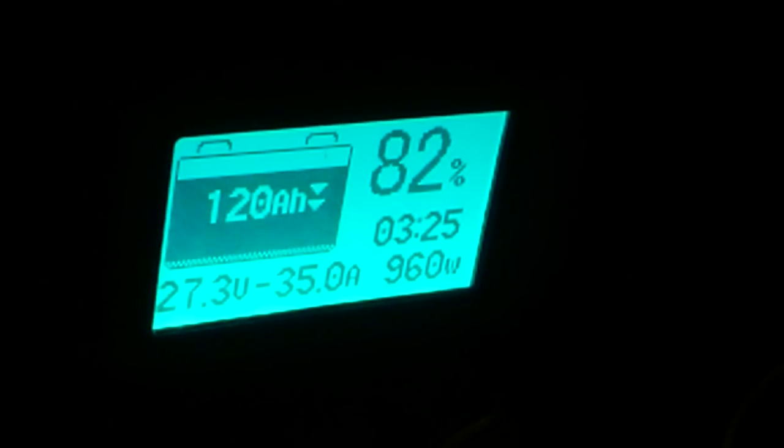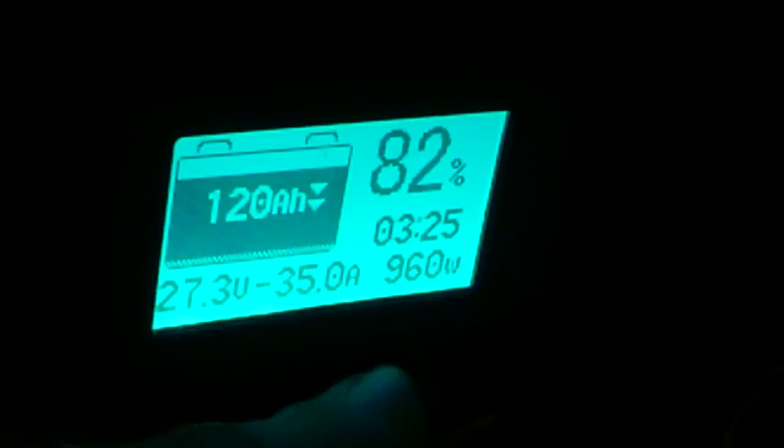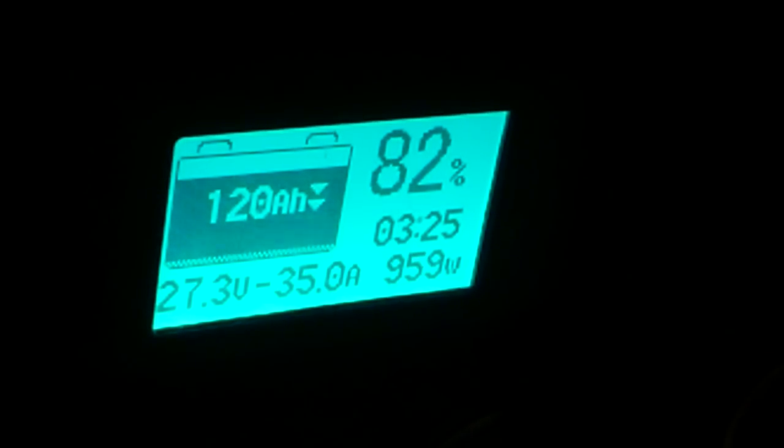So as you can see, folks, the little heater and everything else plugged in is drawing about 960 watts. So that means with those two 2,000 watt lithium ion batteries, this should be no problem to run the little heater for the rest of the evening without draining the system down. So I'm definitely encouraged by that. And naturally, just as you would expect when the room has been heated up here, it doesn't take much, this place is so well insulated, that the heater's shut off.